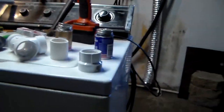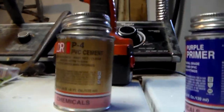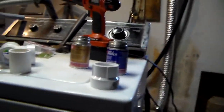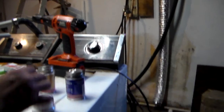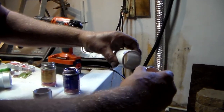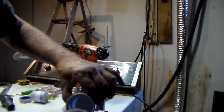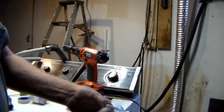Anyway, I'm going to glue the top part together. We're using PVC pipe cement and purple primer, which is standard. Pat's going to hold the camera while I do that, just so you can watch for those of you who don't know how this works. First, a little primer around the outsides of everything that's going to get stuck together to clean it. And this is the T — that really needs it because I already had it put in place to make sure it has a mock-up fit.